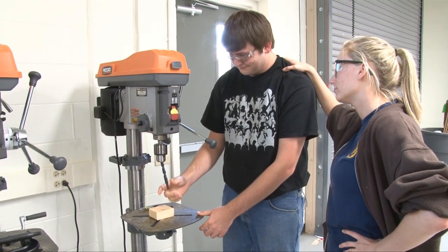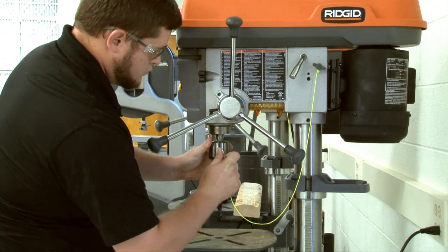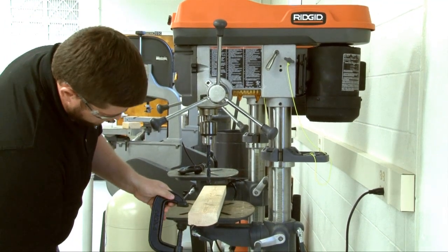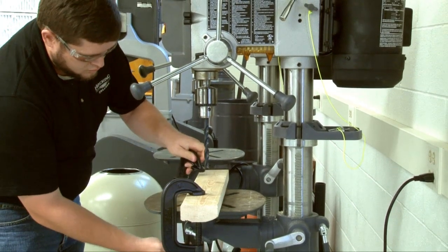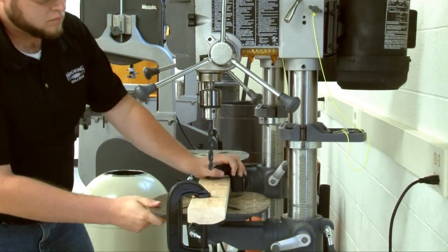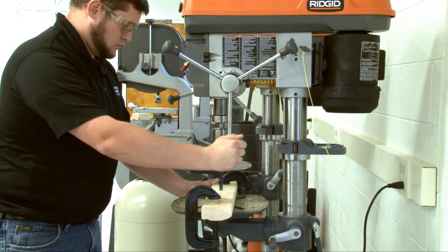You know the drill. Make sure you're using the correct drill bit for the job — using the wrong drill bit can cause damage to your material. Use clamps or a vise to secure the material to the support table so your hands are free. When setting up the drill press, make sure your material is centered on the support table so you don't drill into the table. If you have any questions, please read the owner's manual or ask the instructors for assistance.